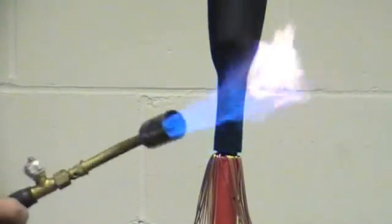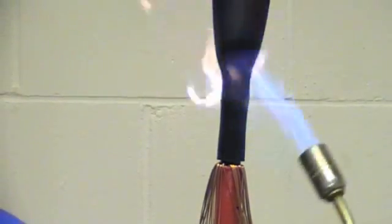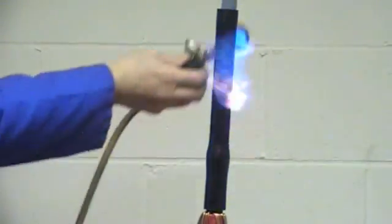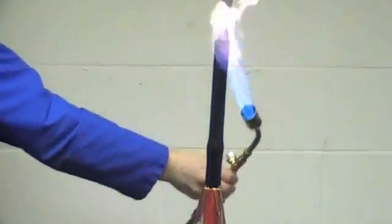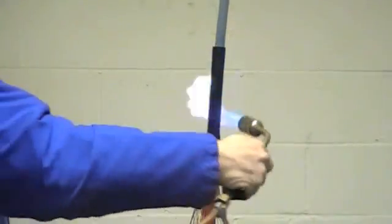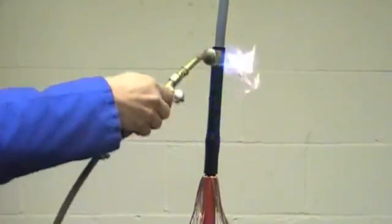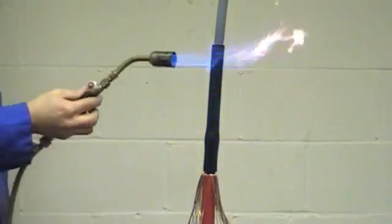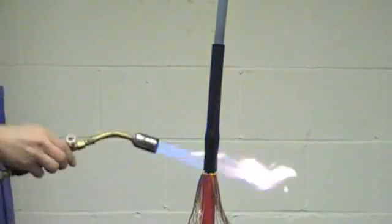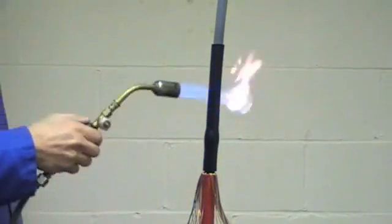The cable installation preparation is similar for 33kV as it is for 11, 17, and 24kV — just the component size and length differ. Make sure the stress control tube is completely shrunk down and fully recovered.